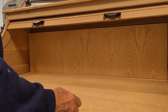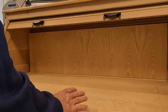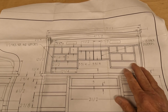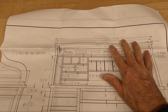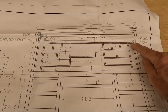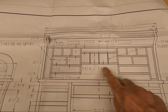Let's take a look at the inside. Basically we can consider the desk finished as-is — sanding and finishing would come next — but no roll top desk is complete without useless cubbies, so let's start working on those. These are the plans for the cubbies we're going to be building. The total dimension across is 51 and a half inches, fitting within the back wall of the desk. We're going to have six drawers on each side, plus two panels — not drawers, but panels that can be used to store computer cables or something like that.